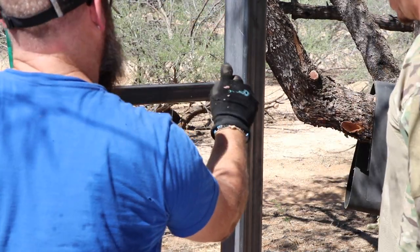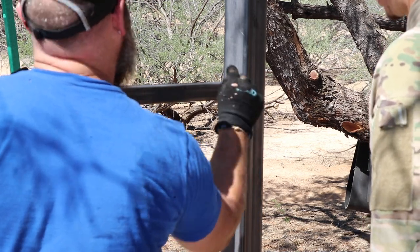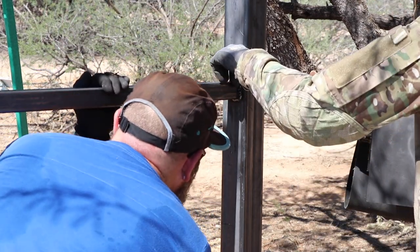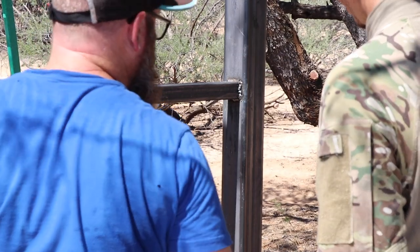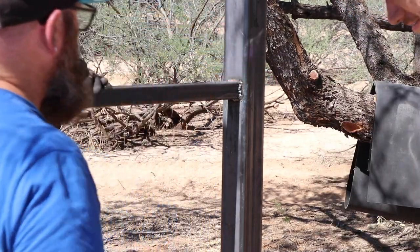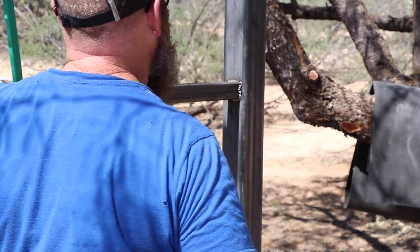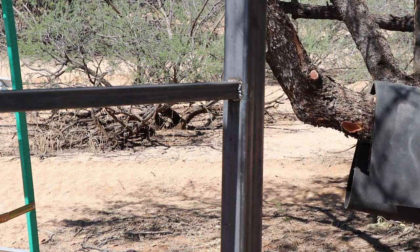And your distance was too far away, and so you're just not really heating the metal, you're just welding metal wire up against it. So that one's not too bad, but these are good. You did a good job on those, and they're going to be hot for a while, so don't touch them. We'll just take a flap grinder to it and redo it a little bit. It's not a big problem. Really strengthen up these posts.